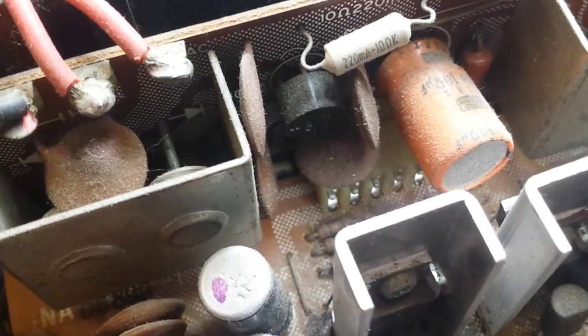The other thing that goes wrong related to the regulated power supply board — there's a four or five pin connector right there. That connector solders on the other side of the board, and you can see the quality of the solder is kind of cruddy. At least two of those five pins will break loose, usually the outer ones, which is true of this one too. We need to resolder those.